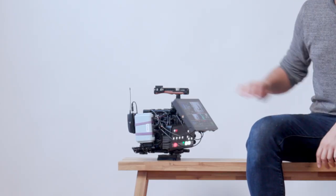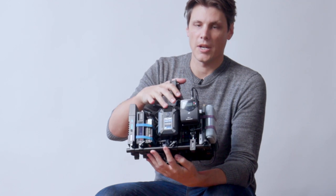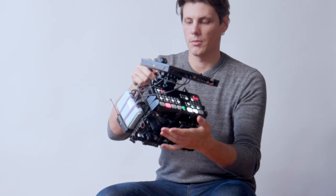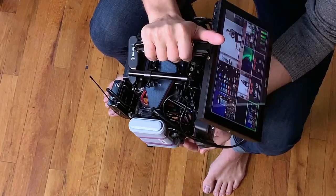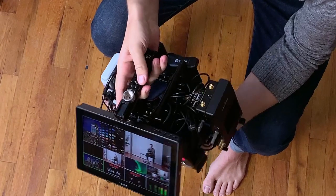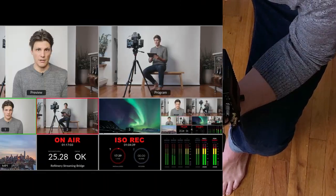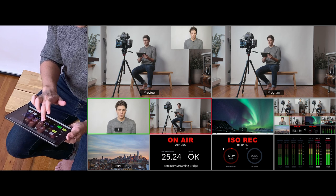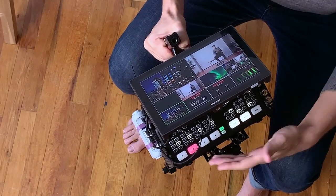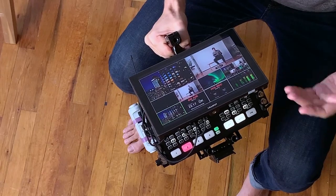And that's this fella. So this unit is fully self-contained. It can run off a single AC power connection, but at the moment I've actually got it running off a V-mount battery, hence why I can have it with no cables attached. It's running wirelessly through this little router here and I've got a switch inside. I've also got a Raspberry Pi in the back which is running Companion so that I can control that through my phone, my tablet, or even remotely through another computer. I don't really use the switching panel, hence why I was able to mount it vertically and just pull it out of the way. And then all of my switching goes through Companion.